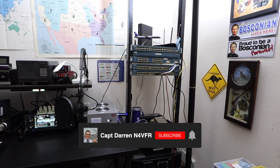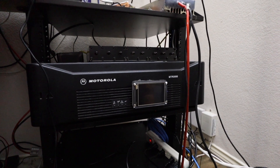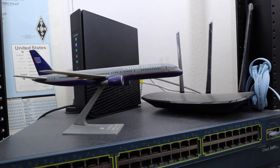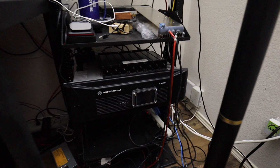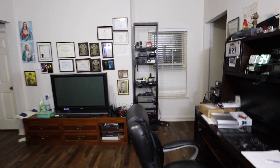I'm very impressed with Conrad's setup, and he's going to talk about several repeaters he has at his location. This is the Motorola MTR 2000 UHF repeater that I'm using for digital — I converted it to support C4FM, DMR, and D-Star. These are my switches, routers, and Cisco switch. How much power does this repeater put out? It's capable of 100 watts, but I only set it to 60 watts.